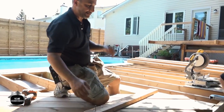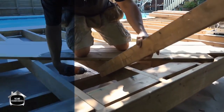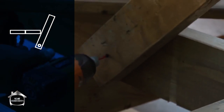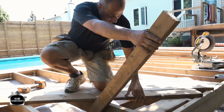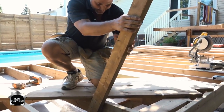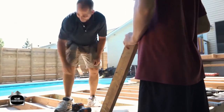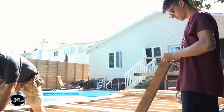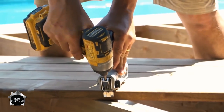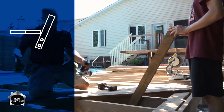In this situation, the board needs a little bit of help to sit where it needs to go. The best way is to put a screw through a 2x4 directly underneath the lead edge, and then with a moderate amount of pressure you can push that board back and forth. This is reusable — you can pull the screw out and set it up over and over. If you're working alone, get in a position where you like it, throw a second screw in, and you're good to go. Nate just holds the board in place as we come across, which keeps the gap nice and consistent.